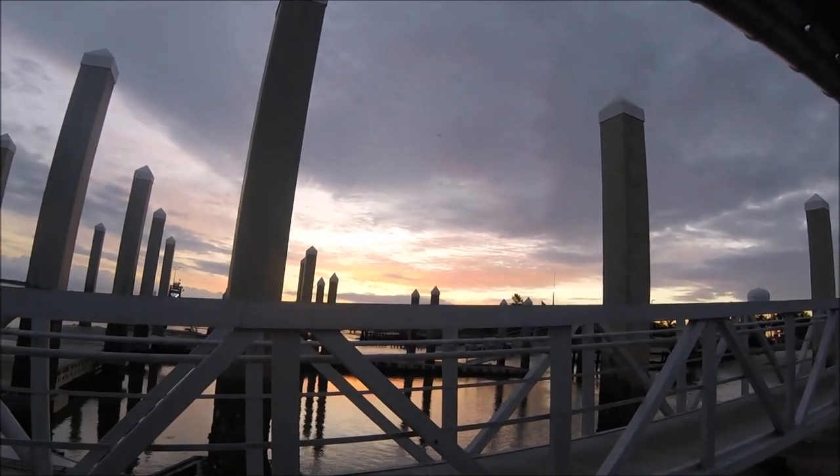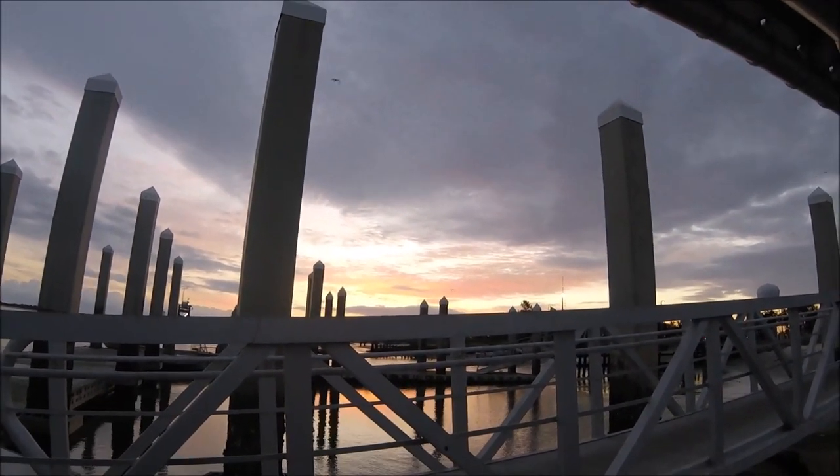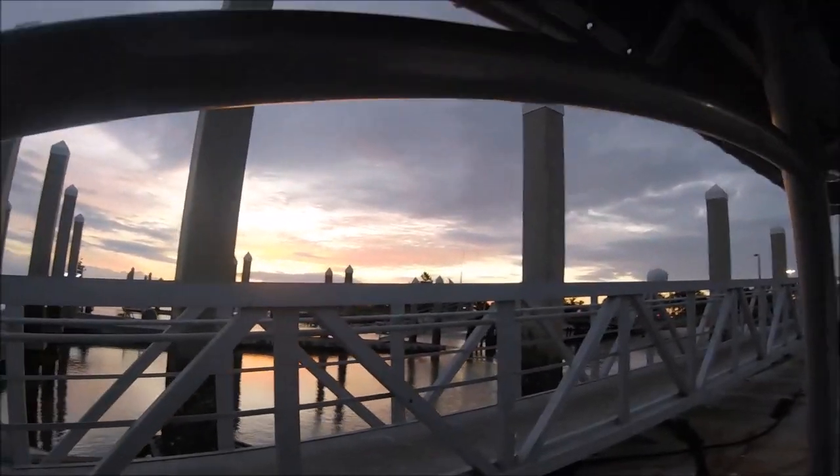Red sky in the morning, mariners take warning; red sky at night, mariner's delight. It's the break-in on a Saturday. I'm going to follow the exact directions for the break-in period: in gear at lowest speed for 15-20 minutes, just tootling along; then up to 3,000 RPM for the first couple of hours; then the next two hours up to about 4,000 RPM; then the next seven hours or so, normal operation. Full throttle no more than five minutes at a time.